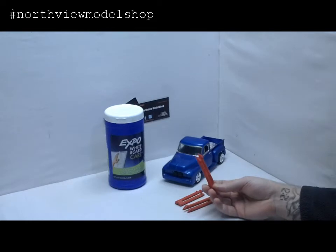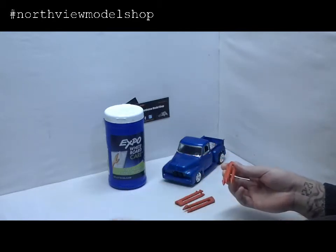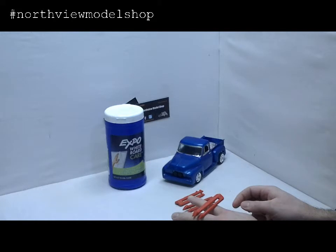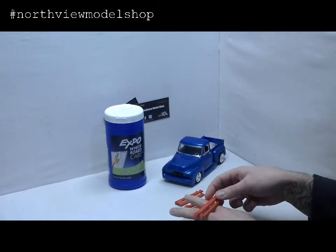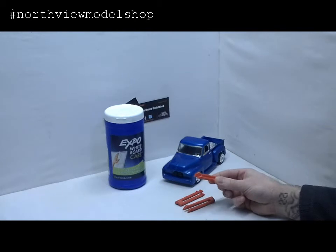You guys probably wonder what these are. When you ship a mobile equipment seatbelt — which is non-highway seatbelts — a lot of times the company will install these little gizmos. They'll pull the seatbelt out and put this through it, locking the belt with the strap hanging out. This eases the installation of the bolt that would bolt your seatbelt to the seat itself, and exposes the hole for the bolt belt. Once you're installed, this pulls out, retracts, and you throw this garbage. Well, we've probably installed four or five hundred of these seatbelts in the last ten or so years.